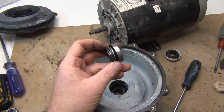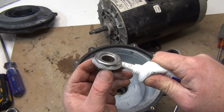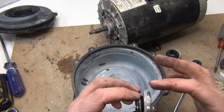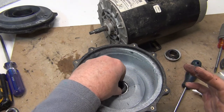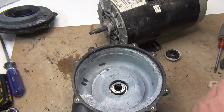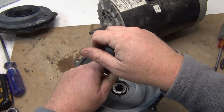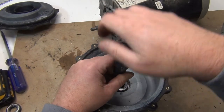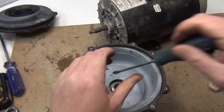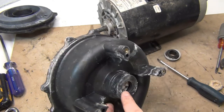We've got the new seal. We're going to put some silicone — just put a bead all around so we get it underneath that groove. Slip it in there and push it down. Use a slotted screwdriver on an angle and just kind of bang it in there all the way down. Pull one side, pull the other, just rocking it in. You'll feel it go solid. There it is — silicone squirted out. Just make sure you don't need to clean up here because it will squeeze out. We're good — we don't have to clean anything out.